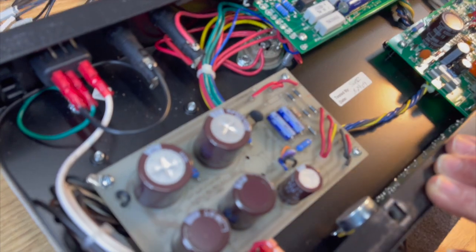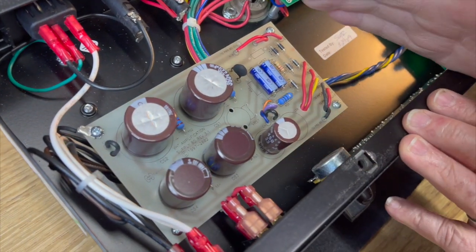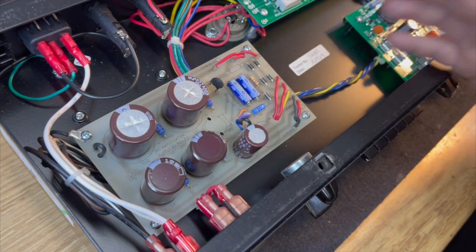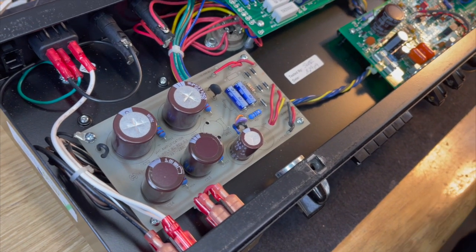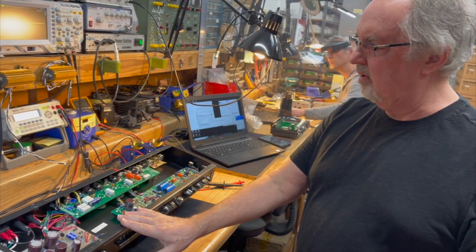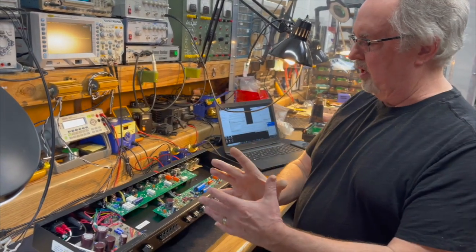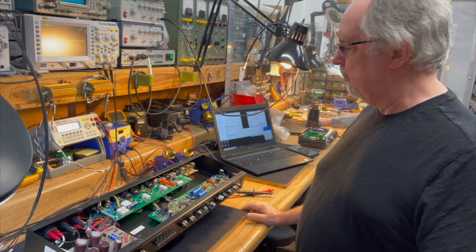There's a lot of wasted real estate there because the mounting holes for the original boards that held the axials didn't change, because we still had the same chassis. We changed the board to radials because we wanted better quality, more plentiful supply, and backup sources of radials. So that board got changed for radial caps, even though the physical size of the board didn't change. So all new designs after this period, the power supply got a lot more compact because it didn't require all that extra board real estate.